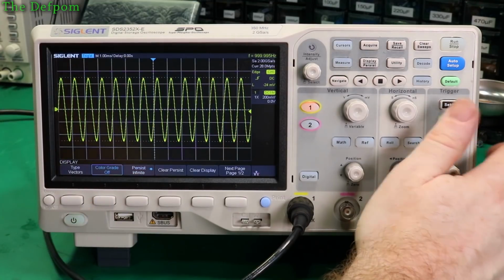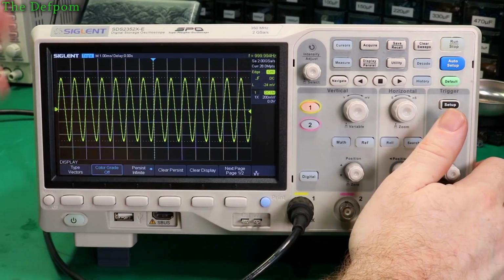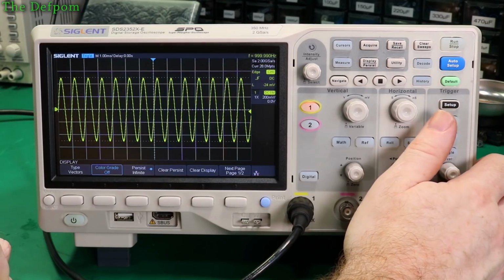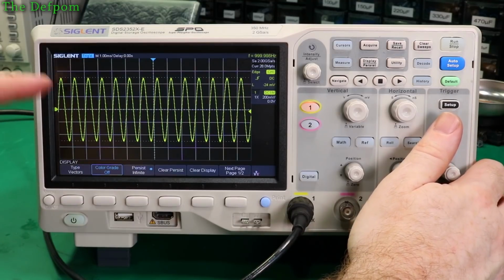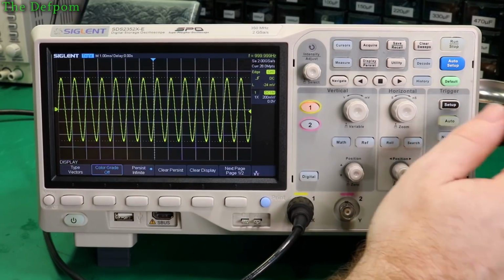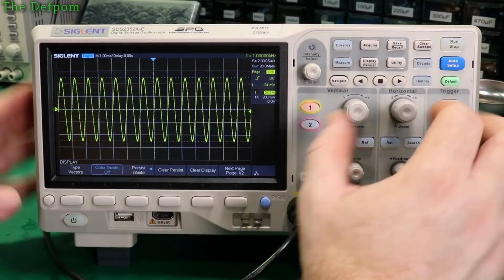Say, for example, you've got an amplitude modulated waveform you're trying to measure. You can actually see the occurrences quite well. Or if you've got a glitchy kind of signal coming in, you can also use that persistence to catch it, so it will show up in the waveforms on the persistence. If it's so fast you may not see it, or may not be able to trigger it very reliably, then it's a nice way of catching those kinds of things.